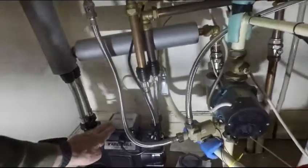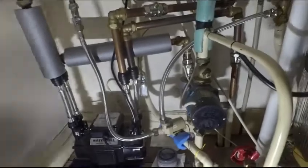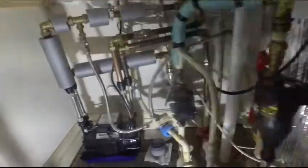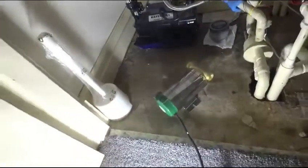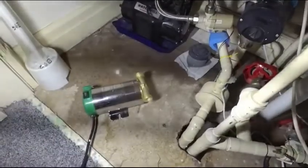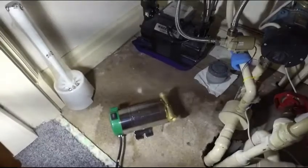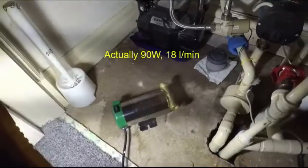This, of course, is just a shower pump, so that's not in the equation today, but this little destrat pump is, and obviously this is the central heating pump. So we'll see how we go. The plan is to swap. This is the alternative I'm going to try today. It's got a brass pump body, and is generally more robust and certainly much more powerful. The little one is rated at something like three or four liters a minute, and this one is something like 12, so it should be significantly better.